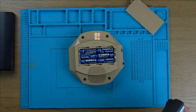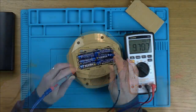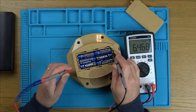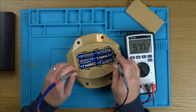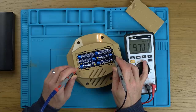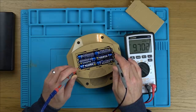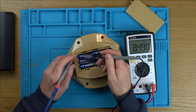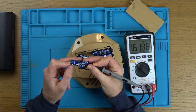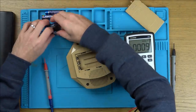First things first, let's see if we've got voltage on the metal contacts here. Let's go to volts DC. Nine volts — it's there to there. Well, we know the battery contacts are okay because I'm on the actual metal itself and we've got 9.7 volts. These are 1.5 each — 1.5 times 6 is going to be 9, but each battery is going to be a little bit higher than 1.5 volts because they're brand new, so they might be like 1.6 volts. That's great news — so now it's going to be more interesting than just faulty battery contacts.